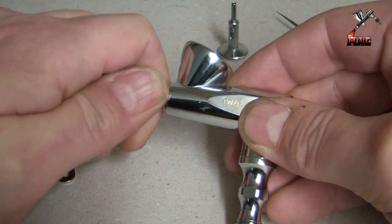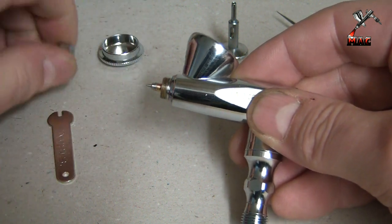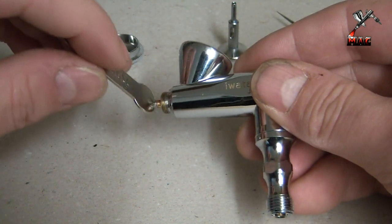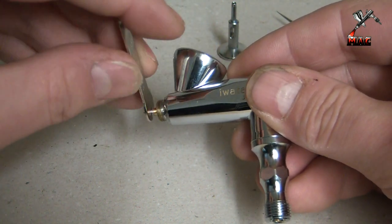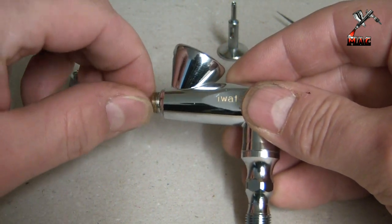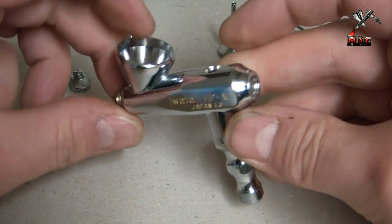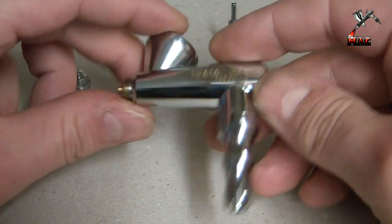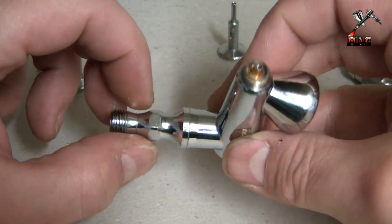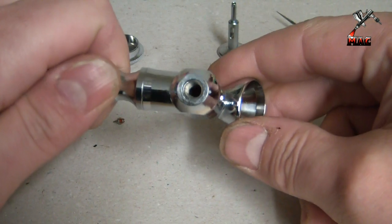This section here is all just screw on, finger tight — that's all you need to do. That will reveal the little nib, and that's where this little spanner comes in. Make it very loose because you don't over-tighten these things, and there's your little nib. This section here is just the valve which connects to your compressor. As you can see it's got a knurled nut there — you can get a spanner and take that off if you wish, but there's absolutely no need whatsoever to remove it.